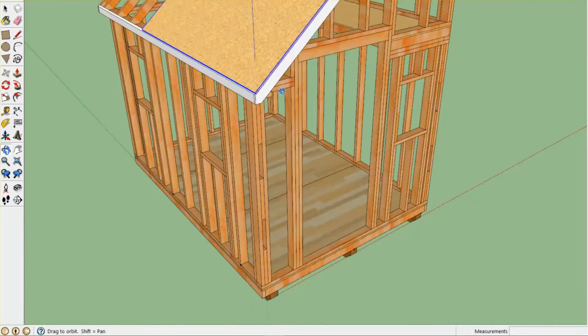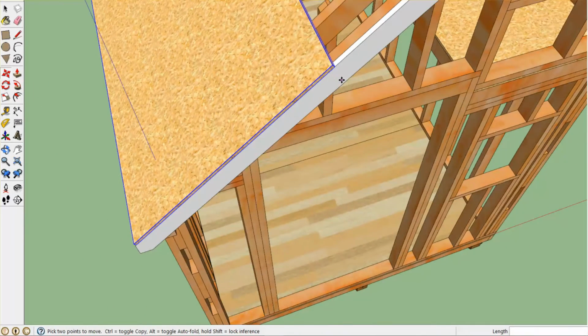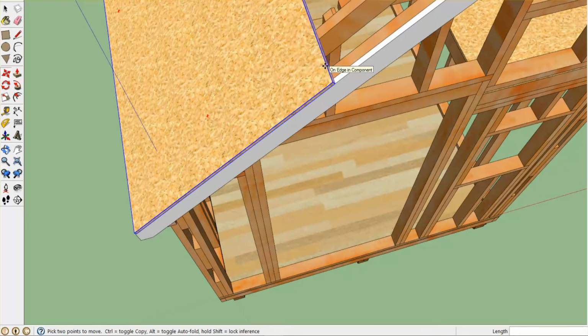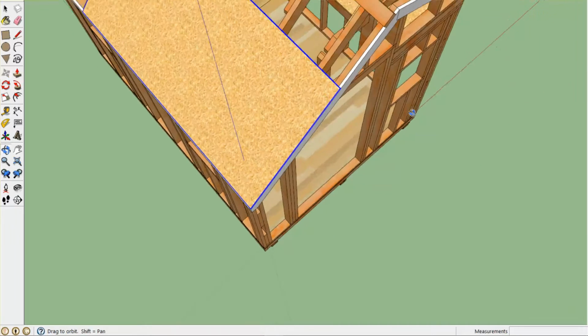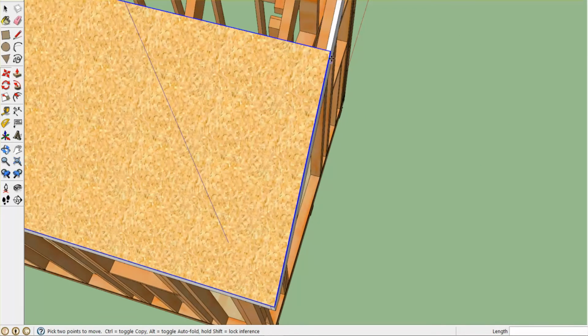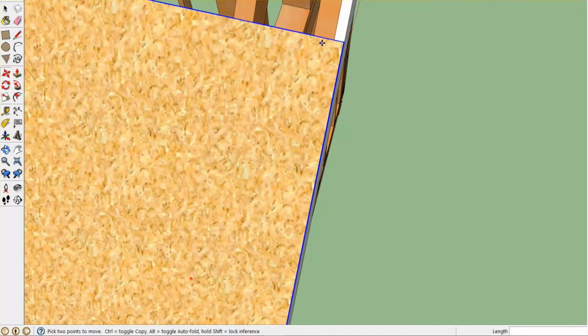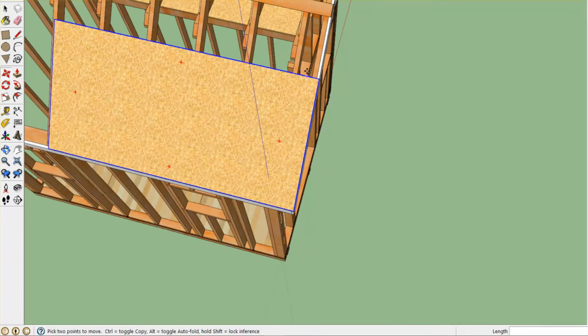Another thing you have to watch for is that we do not extend out past the face of the gable end fascia. We can be back a little bit, up to say a 1/4 inch, but you cannot extend over. Alright, now we're going to get ready to square the roof. You lay this piece in place, get it lined up with your fascia, maybe back up to a 1/4 inch, and you're going to put a few nails, and usually I just temporarily nail, and I will help you with this. Call me over to help you with this. I'll temporarily nail a few down this edge only.